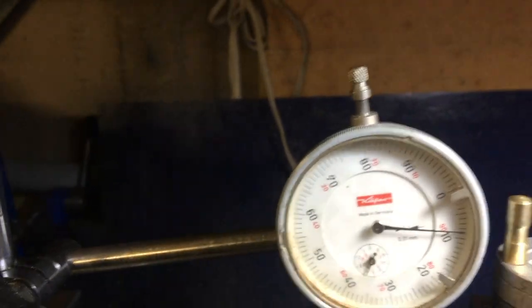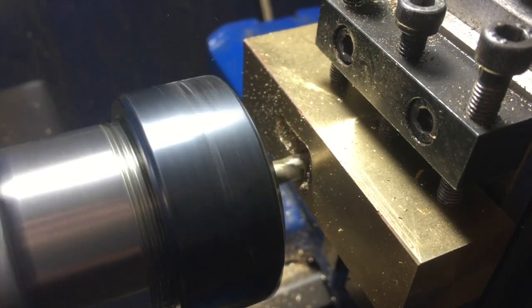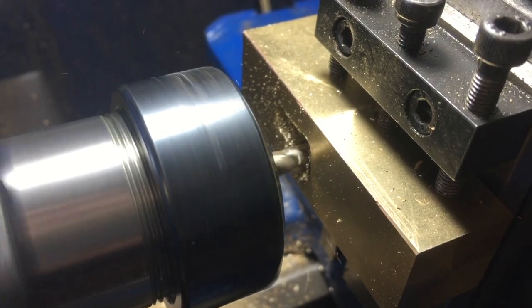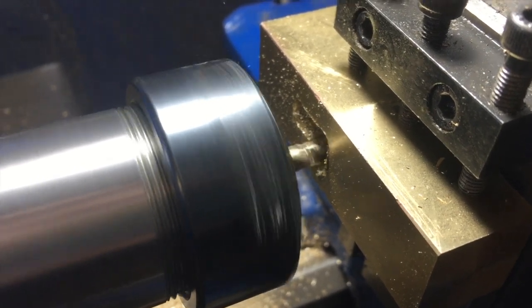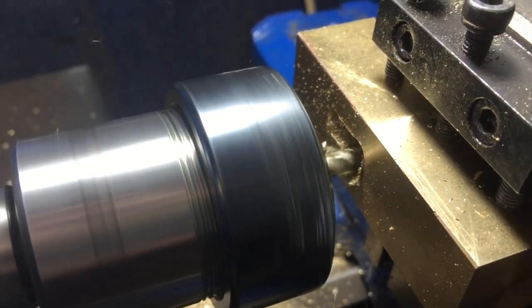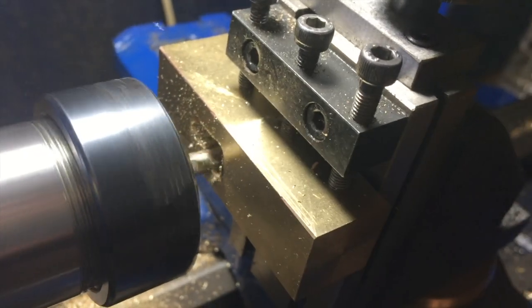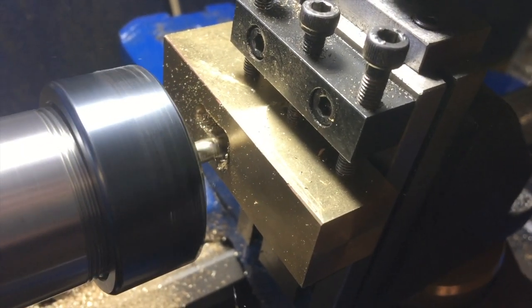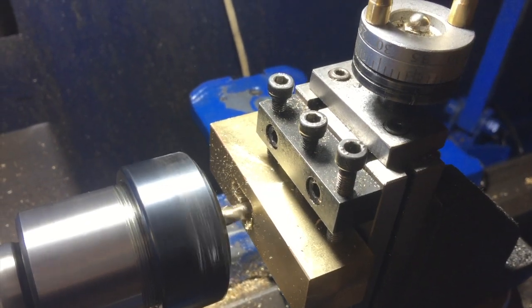The milling tool is an end mill, six millimeters in diameter, placed in a quarter-inch collet chuck. I'm going quite slowly because I've had problems with the work jamming — it's not all that securely held in this lightweight milling attachment.